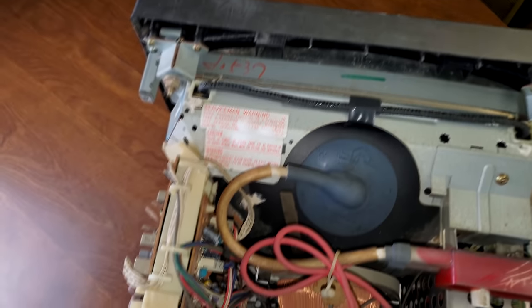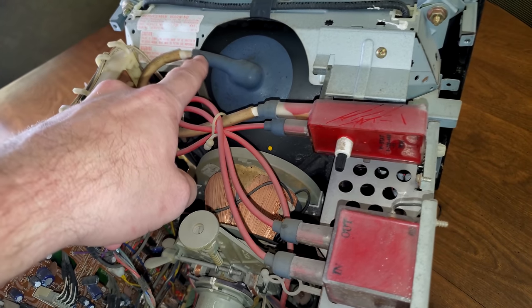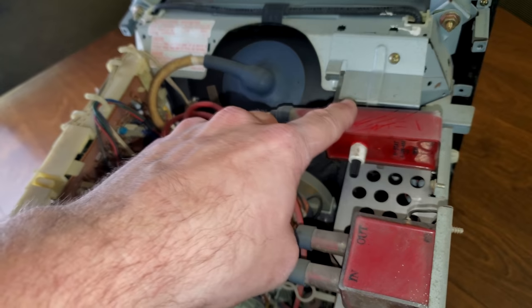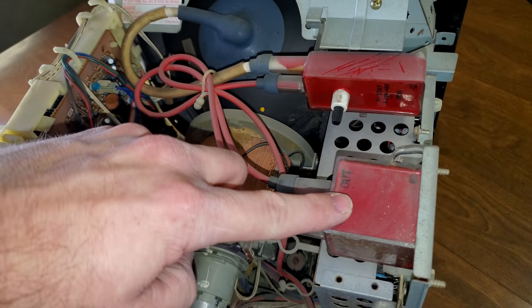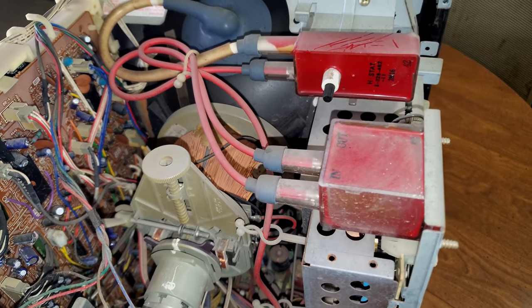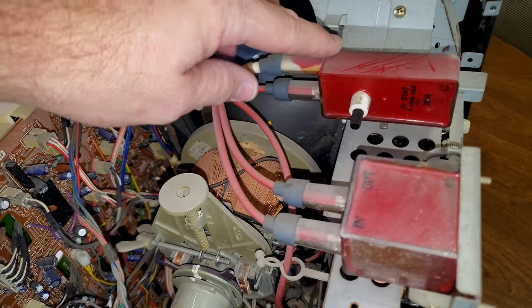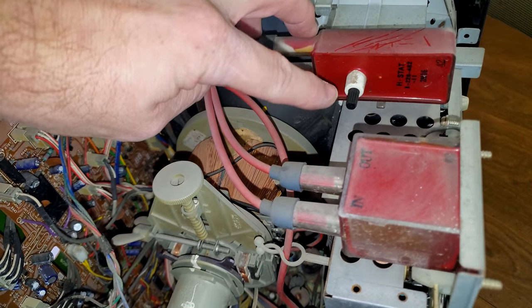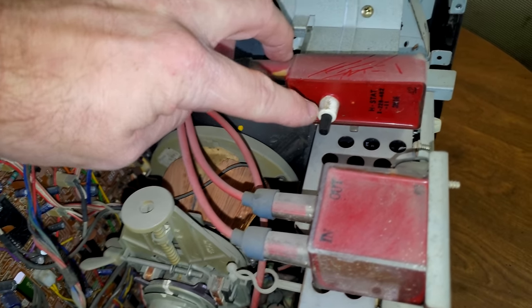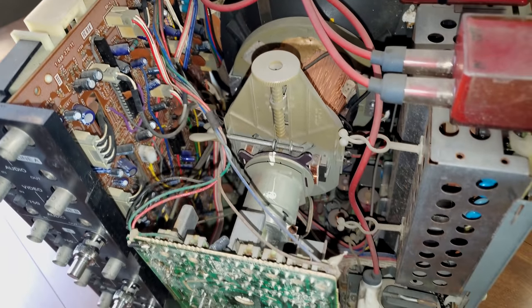All right, let's take a look inside here and see what we've actually got going on. And this is a familiar sight from the 2530. We saw that we'd had this same style of resistor assembly here in the flyback. And this one has it split out even more where you've got the probably resistor in here and here. It's a 2-piece rather than a single piece. And this can be spun to change our horizontal static convergence that we had discussed, so we'll try that out here in a second.